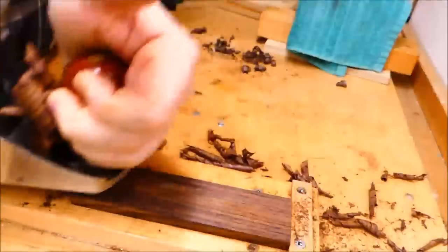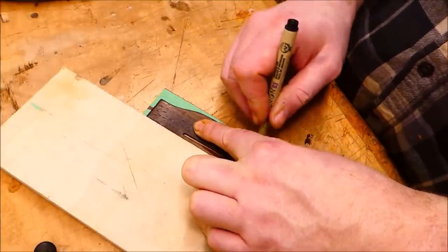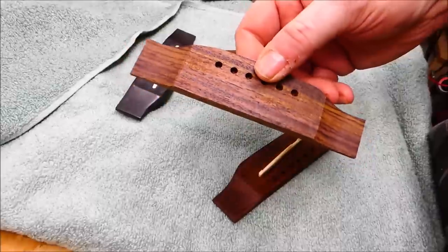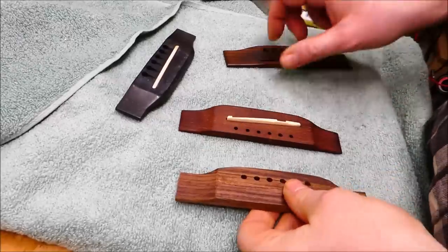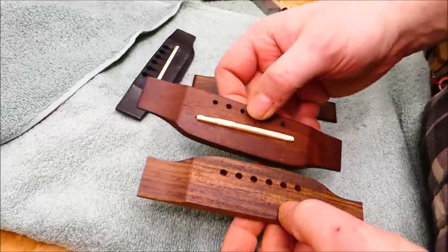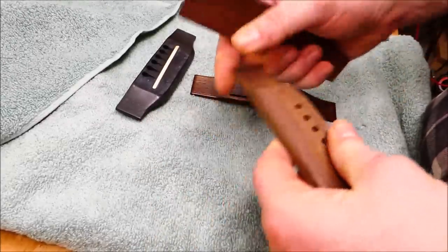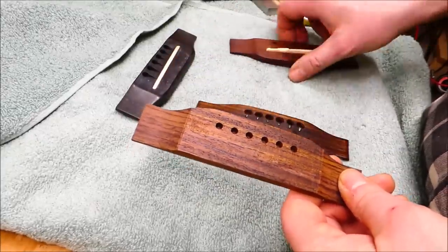Planing a blank for the Hummingbird — this is fun work. I'll scribe the outline from the original bridge, drill some holes for the bridge pins, cut the thing to size and sand the profile. One thing to consider if you're crazy like me and have to do two of these things at the same time from different decades is to make sure you have the right bridge you're working from. Because if you weren't careful, you could turn this around and get the pins on the wrong side. These bridges are virtually identical — it's just that at some point they decided they didn't want the reverse belly anymore and wanted to go with the old-fashioned Martin style.